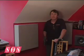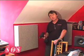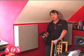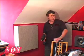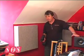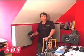We're about halfway through putting up the ghost panels, because on uneven walls they're a bit of a challenge — you've got to jiggle around with the fittings a bit. It helps if you've got two people to help line them up. We've got another four to get up, and then we're going to put a little Roxul foam in places where we think we need to kill some further reflections. The opposing pair here are at the so-called mirror points, which are to try and kill the early reflections that bounce from the monitors off the side walls back to the listening position. Given the position of the window, that's probably as close as we can get to optimal.